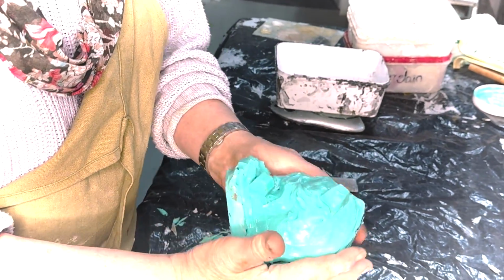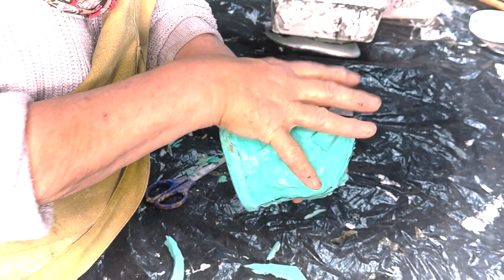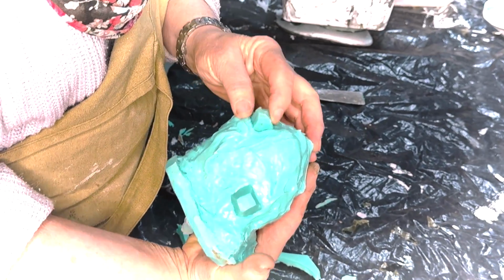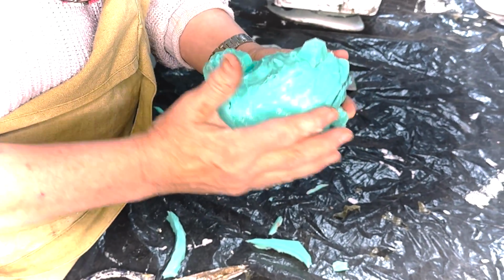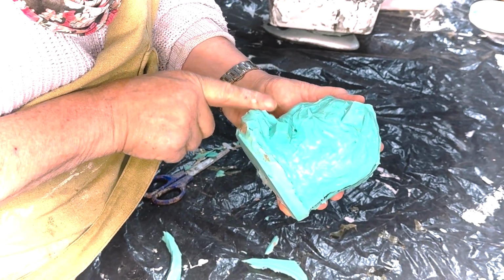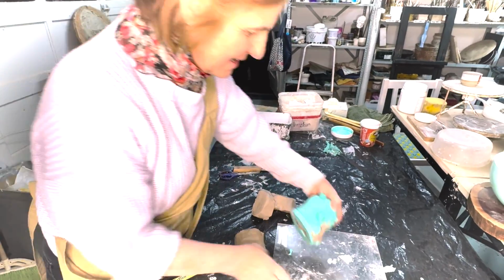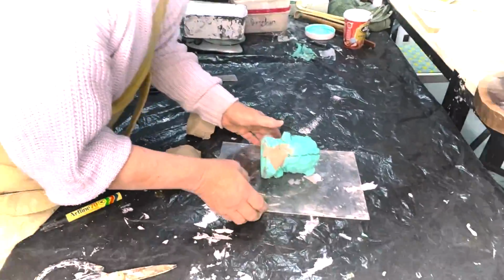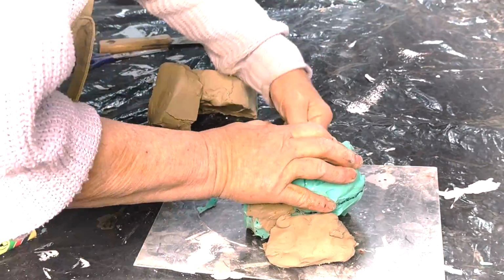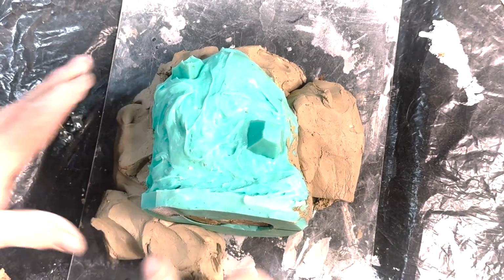I'm going to put it into a bed of clay, and we're going to make one side casing and then turn it over and do the other side. I can see there's a bit of an undercut, but let's just do this side. There's no undercuts here. You don't want the casing sticking anywhere on the silicone rubber. Let's lay it down and into a bed of clay quickly, bedding it down halfway to our halfway mark.